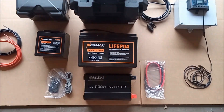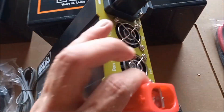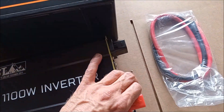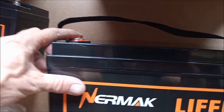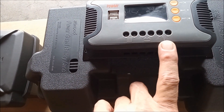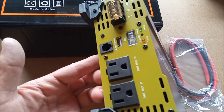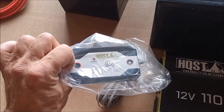Taking a look at the power inverter — this is an 1100 watt 12 volt inverter. On this end, we connect the black negative and red positive cables to the posts on the battery. This is also the same connection point that the charge controller uses. The fan is powered separately over here. This inverter gives you a couple of wall plug-in power outlets and a datacom display that lets you know the status of what things are doing.